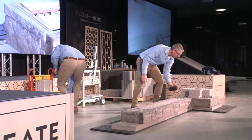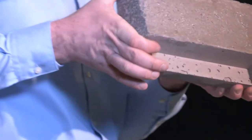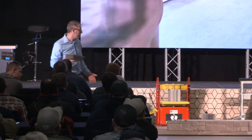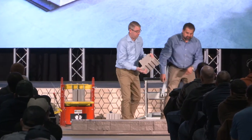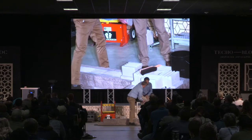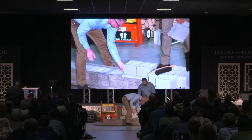Show us what we're doing with this wall, Rick. We already built one row — we have core blocks and we have the fascia units installed on top. We have what they call flats and we have corners as well. This is one of the corner units that's been cut down — smooth top, with a channel that's going to fit into our core block, and then we have the corner on the side. There are left and right corners in the pallet — we just have to make sure we're using the correct one.